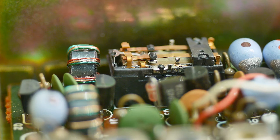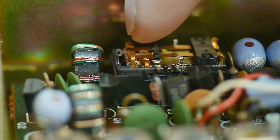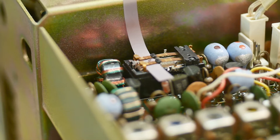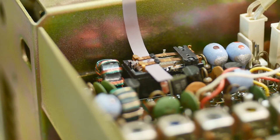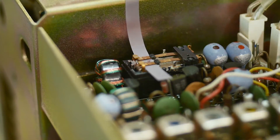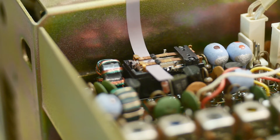Here are the ends of my forceps — yeah, it's pretty tiny down in there. Okay, I've put a little piece of sandpaper in — this is one-micron grit, used for polishing fiber optics, that's why I have it. I'm going to polish these two contacts. Of course it's just polishing one side of them right now.